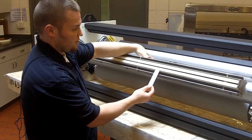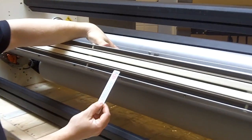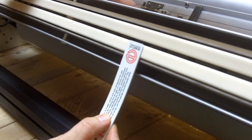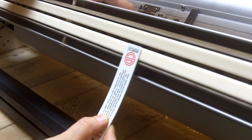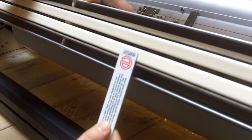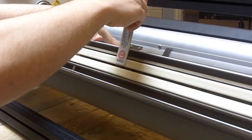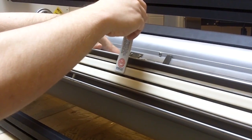So for example, when we check the electrode gap — right now I'm just showing for demonstration purposes with the electrode assembly out — we're going to come in from one side and make sure we have about a 60 thousandths or 1.5 millimeter gap, and then come from the other side and check for a 60 thousandths or 1.5 millimeter gap.